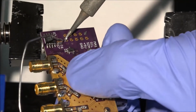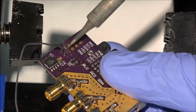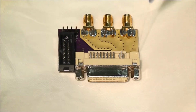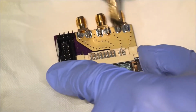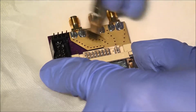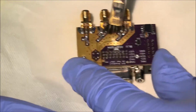Anchor another pin on the opposite side of the connector. Make sure solder goes completely around the pins. Once we're all done soldering, we'll clean all of the flux off with more IPA and scrubbing. Flux that has been burned a bit will take more scrubbing to get off. Make sure you rinse the board with IPA as you scrub to get everything off.